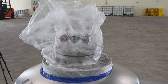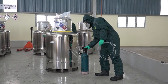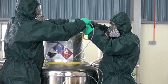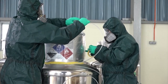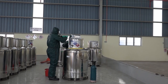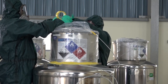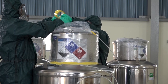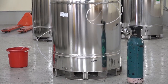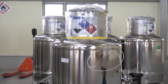After that, connect a nitrogen source to one side of the plastic bag sealed by PVC tape, and at the other side connect to a bucket of caustic chemical solution, which will neutralize TCS carried out with nitrogen purge. The final condition of valve leakage containment is such that the valve should be covered and sealed by a plastic bag, and with nitrogen purge, the leaked TCS should be reacted out in the bucket.